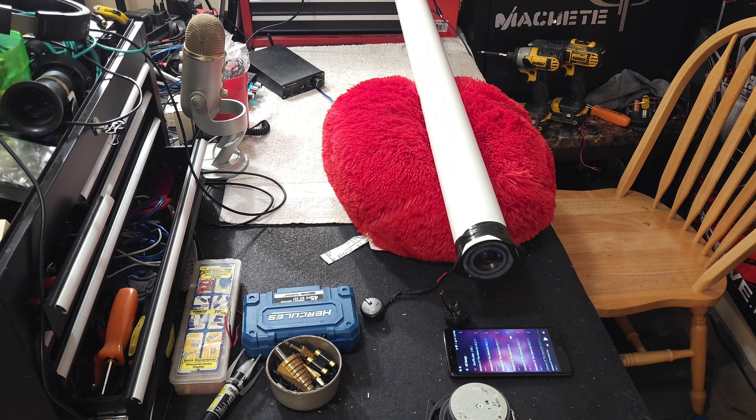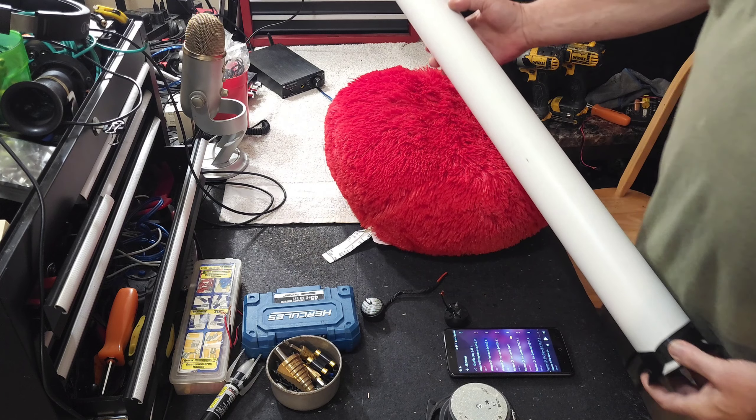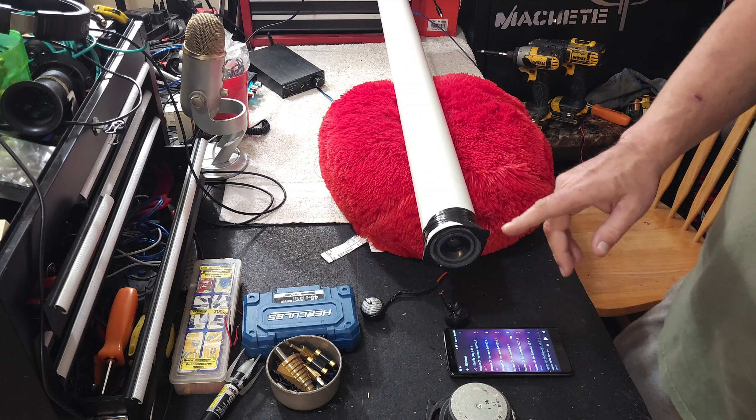What's up guys, we are testing again today. I bet some of y'all already figured out what this is all about despite what you see on the camera. This is my makeshift t-line enclosure — it is approximately 36 inches long, uses a two and three-quarter inch driver and a three inch piece of PVC pipe. I did some minor calculations to find what frequency this should be tuned to, and according to the speed of sound, the 1130 divided by four for a quarter wave, this should play around 90 Hertz.